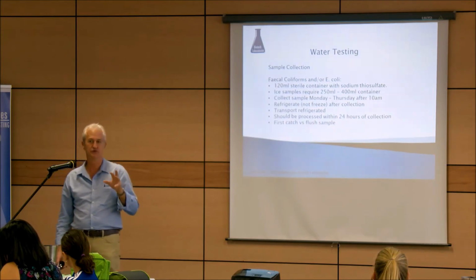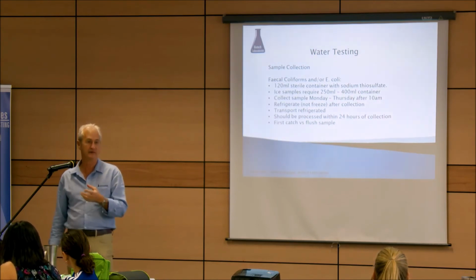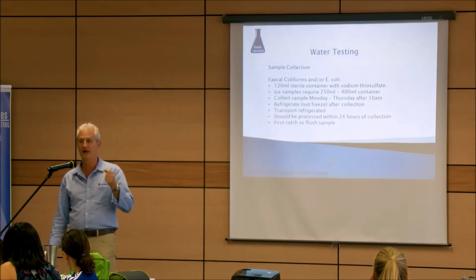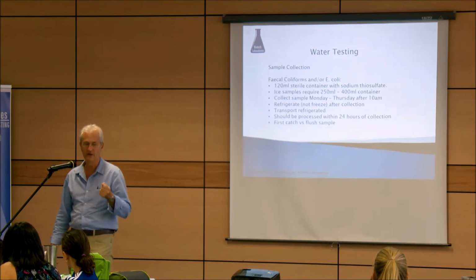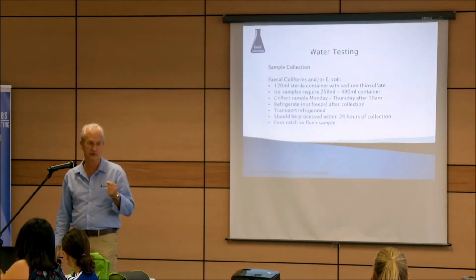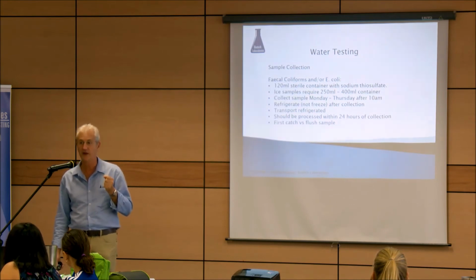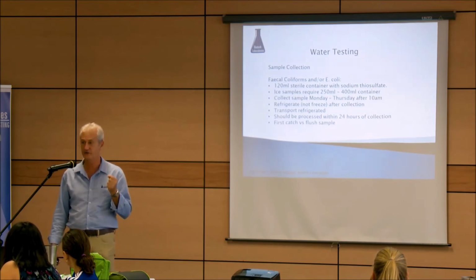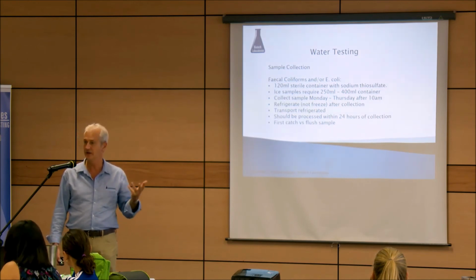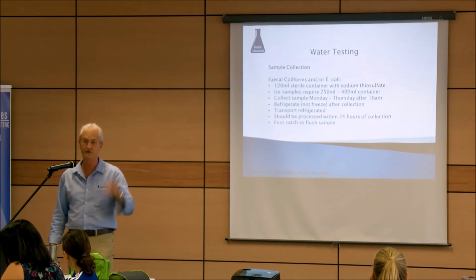There's a bit of controversy on how you take a water sample. Should you be doing a first catch, turning on the tap and taking it? Or following the Australian guidelines for water collection, where you have to flame the tap, run it for a certain time and then take the water sample? I would basically say, how do you use the water? If every time you go to use that water you have a little flamethrower in your hand and you burn the tap, then turn it on and run it for a couple of minutes, that's how you should collect the sample. But if you don't, you want to know if that water quality is okay. So however you use it, take the sample that way. If you just turn on the tap and that's how you use it, do that.